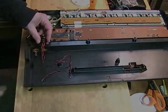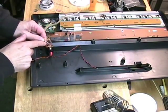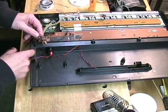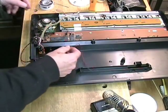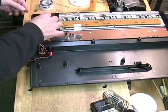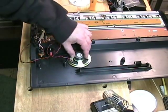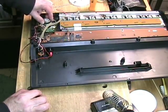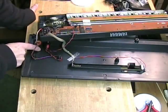That's part of the reason why I made so much extra wire and pre-soldered it — so I'm going to mount the switch first. The jack is now wired and the heat shrink tubing is shrunk onto it, so it is a nice tight connection. This will go through the hole and lock down. The speaker is now wired and can go back into its location and be bolted back down. The jack is mounted in the hole and locked down.